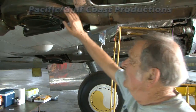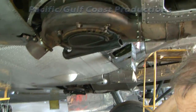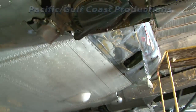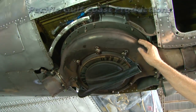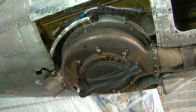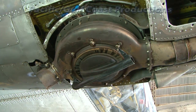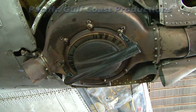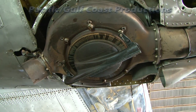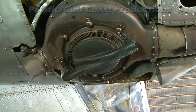This is your turbo supercharger, which is controlled electronically on this model — the G model — the first model with a setting where you simply turn a dial, set your boost, and away you go. This air cooling device picks up ram air from the forward motion of the airplane to cool the bucket wheel down below what it would otherwise reach without it.